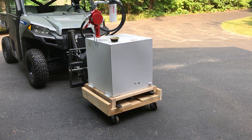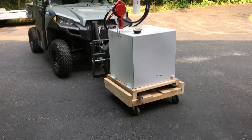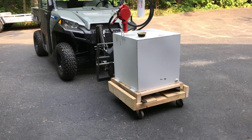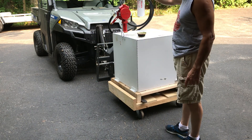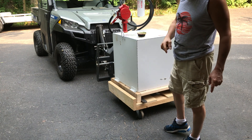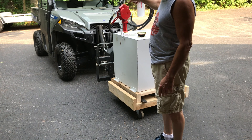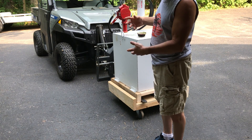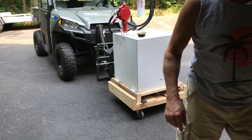That's the fuel tank upgrade. I upgraded from those cans there underneath that tub — I think I got four of them under there. That's my trailer that I take it to fill up. I believe the shelf life on diesel is two years, and Brutus is diesel. My new generator is diesel, and both my vehicles — my truck and my wife's car — are both diesel. The plan is I should go through 50 gallons with Brutus in a two-year period, and if I need the generator as well. If I don't, I can always put it in my truck to make sure I'm going through it within two years.